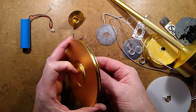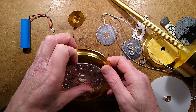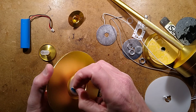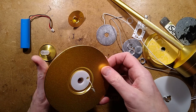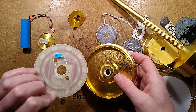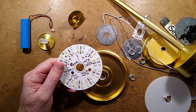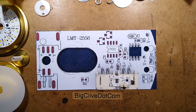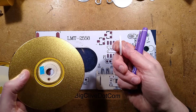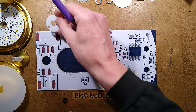The wires are off, let's unscrew this and see what else comes apart and take a closer look at this circuit board. There is a metal washer that holds that circuit board in place. There is the antenna, basically round the top, and this presses down on it — it was triggering absolutely everything. I think that's just purely the vicinity of the circuit board and its general ground. I've also printed a new spacer — this is the original 3mm thick spacer, I've printed a 6mm thick one on the 3D printer just to see if that helps with the spacing of the touch sensor.